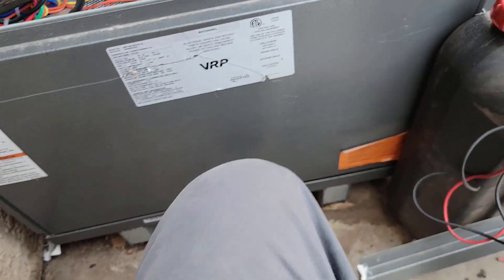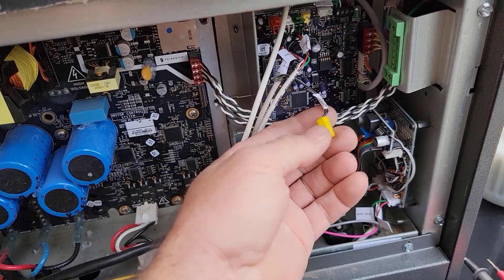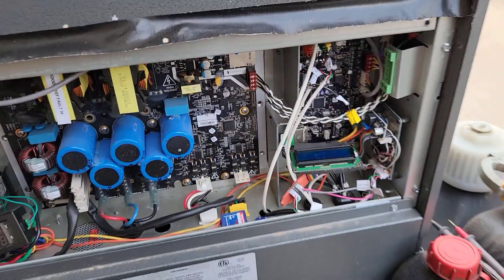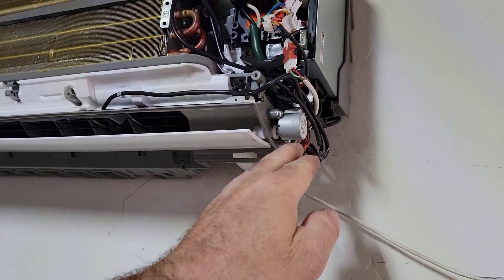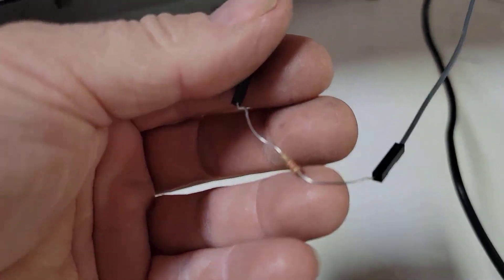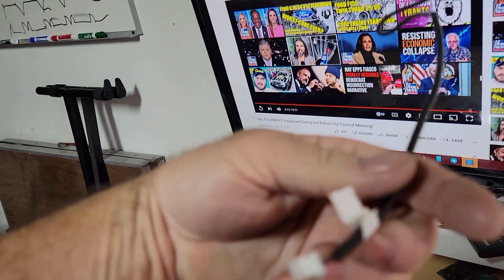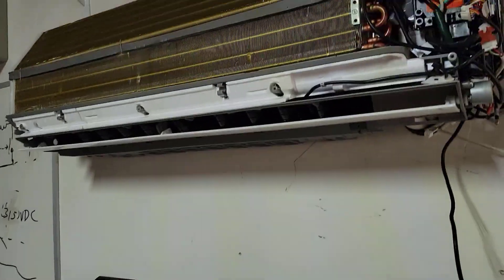The wire broke inside, so I put a resistor in there to make sure I'm on the right one and that no wires are crossed. It's reading the value of the resistor, which is 220K ohms — looks like it's good. A good way to track down which thermistor you're working on: I put a fixed known resistor of about 220K on there and confirmed the reading.